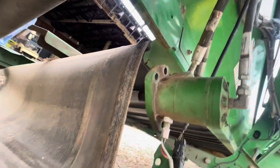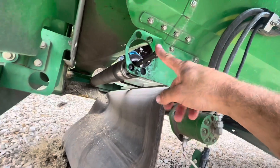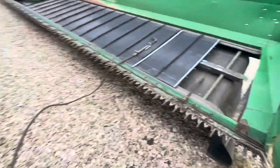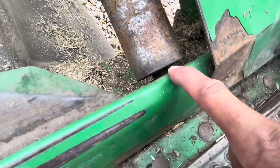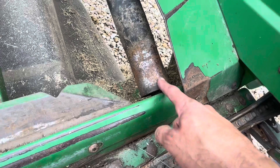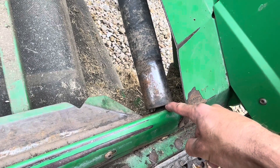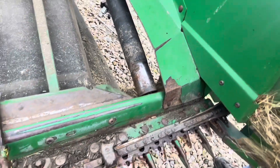We took the four bolts out but we still can't get this roller off the end shaft. Alex stuck something in here so it can rest and not have all that weight twisting down. The bearing has to slide off that hex shaft — if it stays with the roller we can't get it off. So we're going to try heating up the outer side of the roller, hoping the bearing will stay stuck on the shaft so we can stick a puller on it.